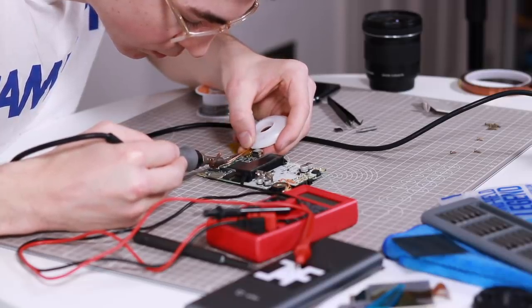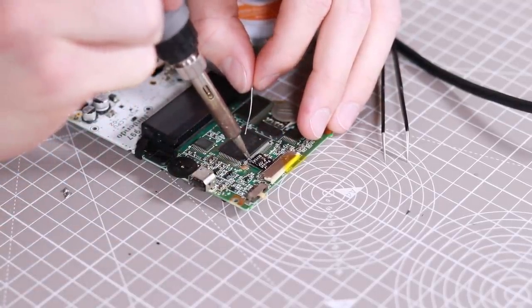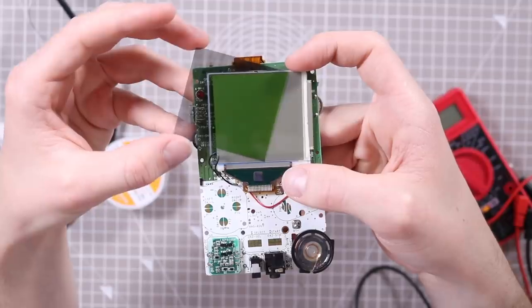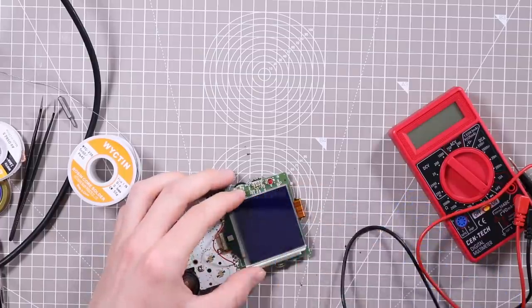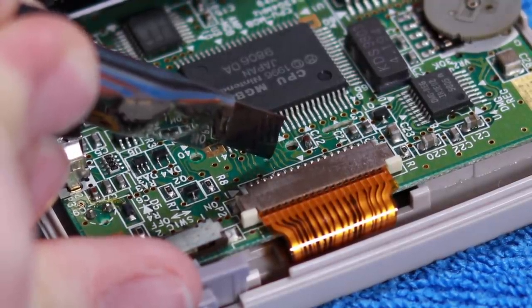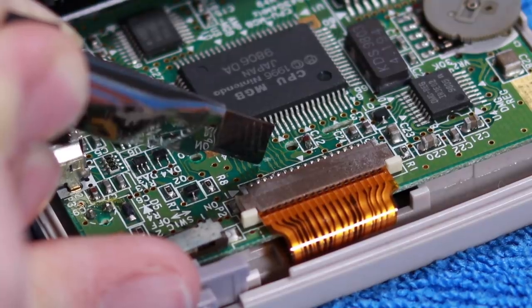Then start to bridge the pads to the pins on the connectors. Be careful not to actually bridge the two pins. I then spent the next 20 minutes trying to remove that blob of solder and went back at it again and successfully managed to bridge those contacts. The Bivert chip takes power from the C12 resistor and after soldering all of that together you're done. I went ahead and reassembled the Game Boy, ensuring to flip that polariser film round to the slightly darker orientation, gave it a quick clean, buttoned it back up, popped some batteries in — and where has my display gone? I managed to completely forget to cut the traces, basically I just didn't do anything.